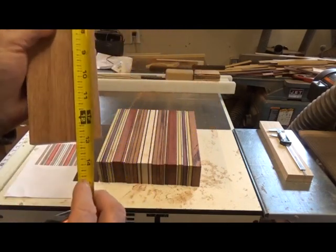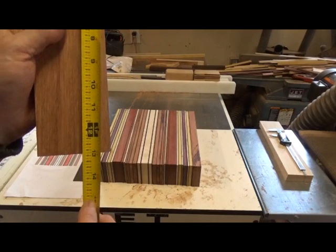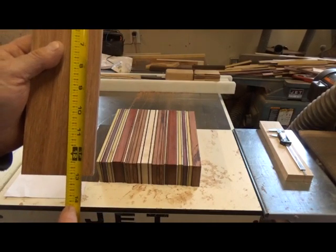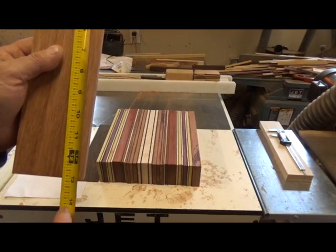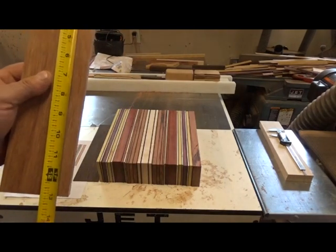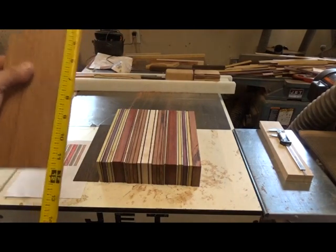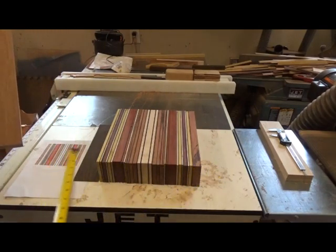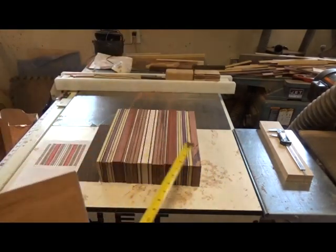Boards are around — well, this one's about 13 inches. I'm counting on about 12 and a half, 12 and three quarters by the time I'm done. I'll show you further when I get further. The next step here is going to be to glue all these boards together. Right now they're loose and there's around 60 or so separate boards here if you count them all.